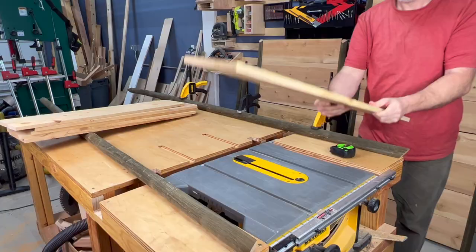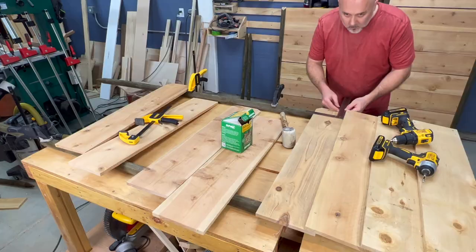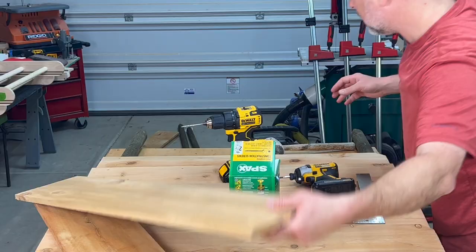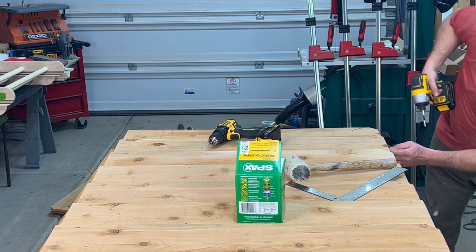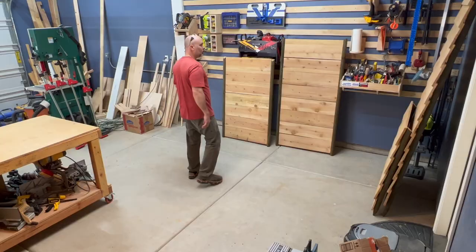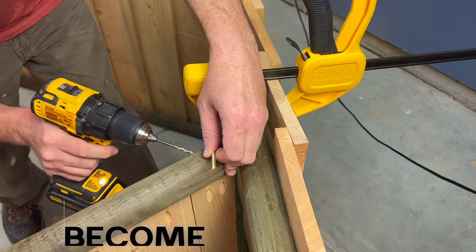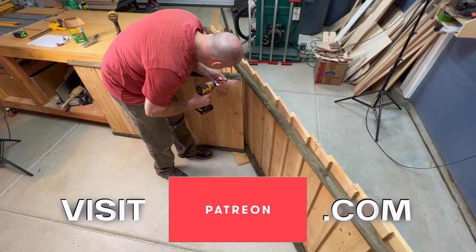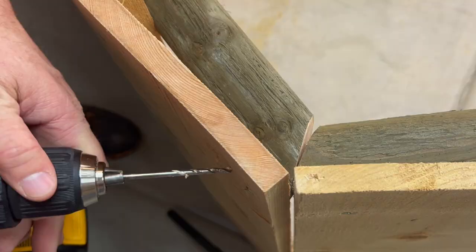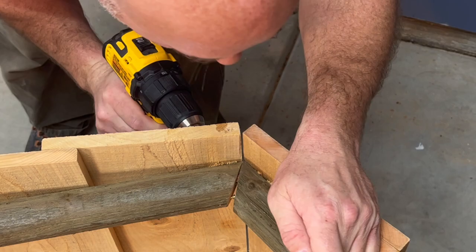Just like that they're a little more narrow. It took a little work, but once I solved that problem things got easier. All I had to do was make sure all of my tree posts lined up from the walls to the roof, and that the roof planks were all staggered evenly. I used my ruler to make sure everything was looking good. I fastened all of the pieces together using three and a half inch construction screws, drilling pilot holes for all the screws so I wouldn't split the wood. If you look closely you can see moisture from the wood bubble up as I'm drilling into those cedar planks.